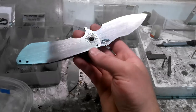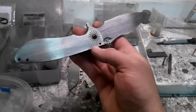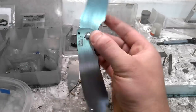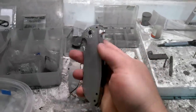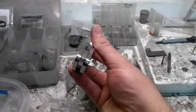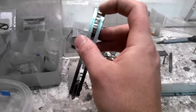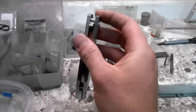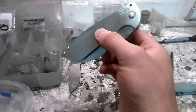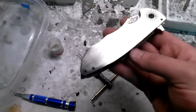I don't do a normal heat treat on it — I had to figure out what I wanted to do with it heat treat-wise, and I think the heat treat I'm running is pretty substantial, yielding a good blade. It's uber-stainless because it's got a lot of nitrogen in it, replacing those chromium carbides. This is bearing-assisted — they'll have ceramic bearings, steel lock bar inserts, probably rolling detents. They'll have breakers and stop-pins made out of N690 as well — that's actually a part I can make on the CNC now. There are only going to be 20 of these made because it's basically all the steel I can get a hold of, unless I want to spend $30,000 getting steel from Austria, which is not going to happen.